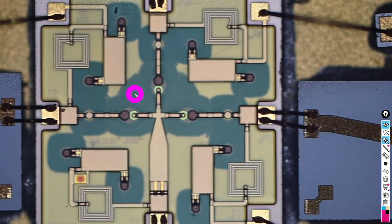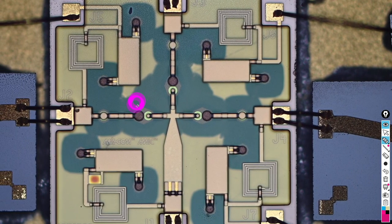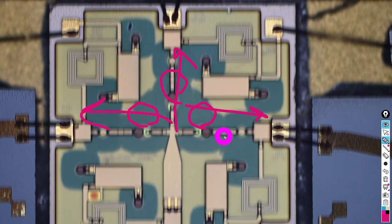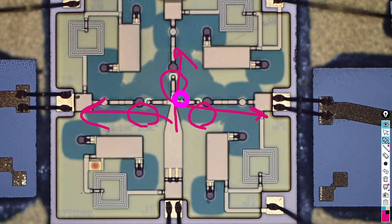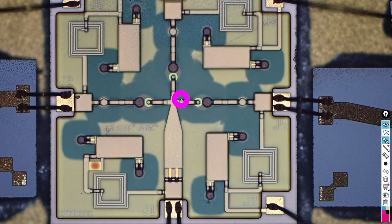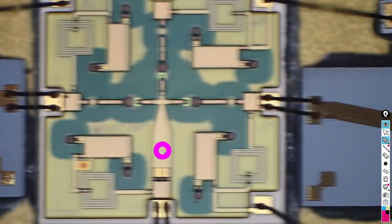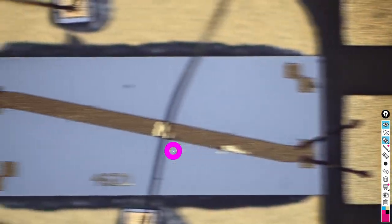This is our triple switch. This is actually not by Agilent — it's a different part here. There are three pin diode switches. The signal can be turned on and off depending on the configuration of these pin diode switches — either this way, or that way, or that way. We know that there are three bandpass filters on this board, and this is how they choose between those three bandpass filters. The outputs go into one of three paths through transitions on the left and right sides.